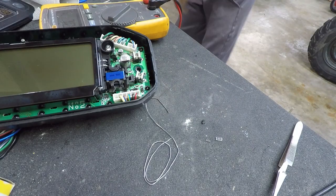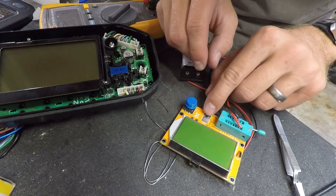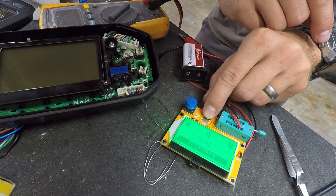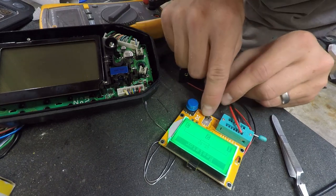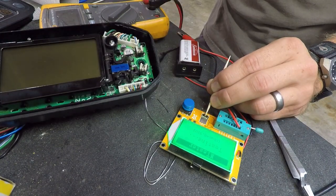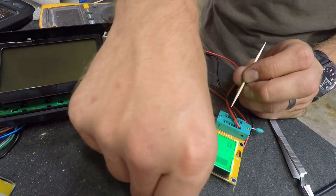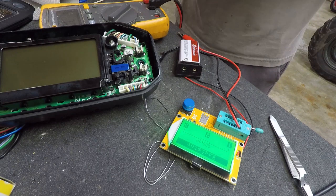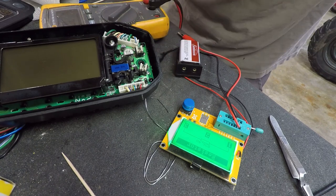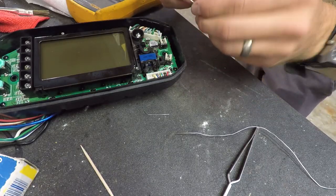DZ1 is shorted. The resistor is reading 23 ohms — that's not right, it's bad. Both the shorted Zener diode and the out-of-spec resistor are pretty close together on the front side of the circuit where all the power input is. Hopefully that leads me in the right direction.